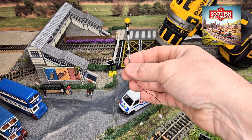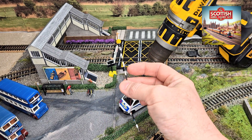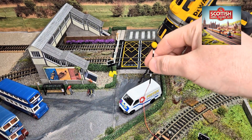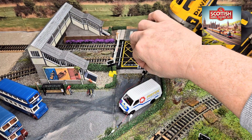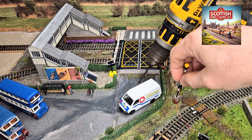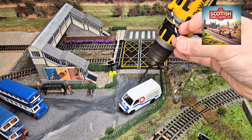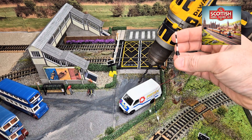When you look at these wee posts, you can see this little piece that slides up and down — you can pick the height you want, and it also gives you enough to stop it falling over. The drill hole has to be bigger than the lower part but smaller than the top piece, otherwise it'll fall through — so double-check that before you go anywhere. Once you get it to the height you want, a little dab of superglue will hold it there forever, so make sure it's at the right height before you do that.